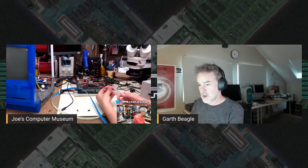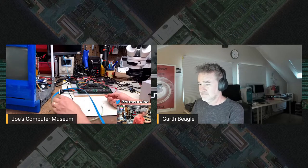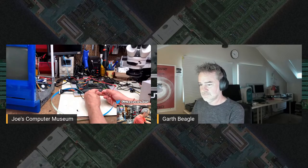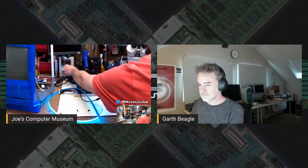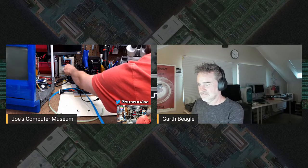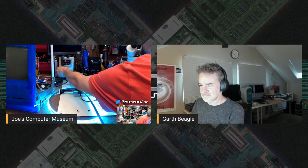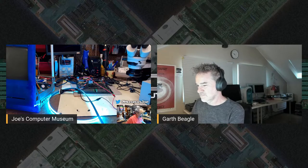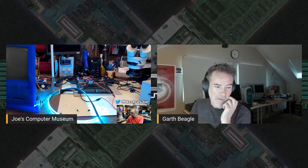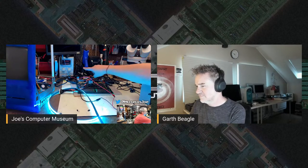So what we do is we put this on the power supply to figure out voltage. Now I have to set the voltage up. Not 25 volts, that'll break it. That's 12 volts, and then we set the current to max and wait to see what it takes. This uses 1.4 amps, so that's a lot. So that is at 1.4, we'll say 1.5. It's actually interesting, you'll see this number creep up.